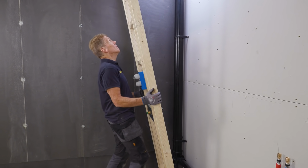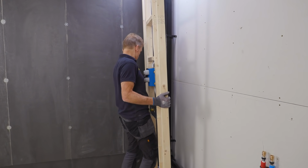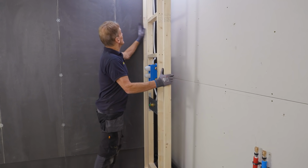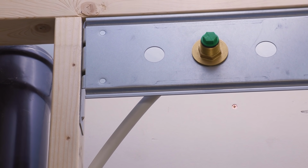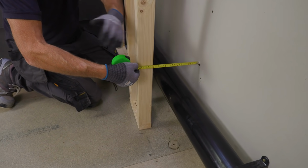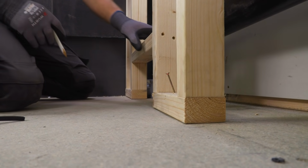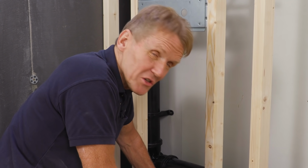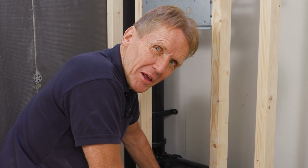The height of the tallest modules is left 20 millimeters clear of the ceiling height to allow you to easily swing them up into place. And then they're simply fixed by screwing up into the joists above. Now, obviously, when you drill into the floor, you've got to make sure there are no pipes and cables. But as I put these ones in, I know exactly where they are.